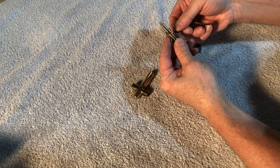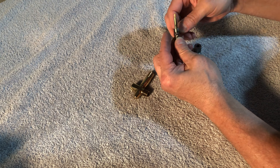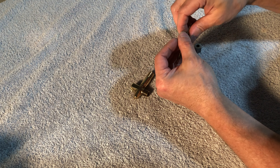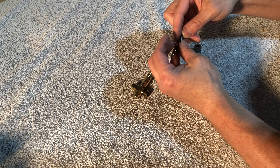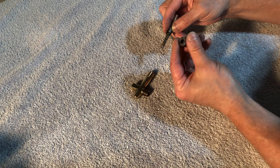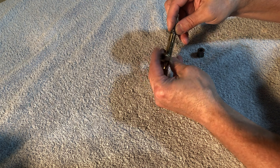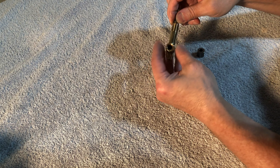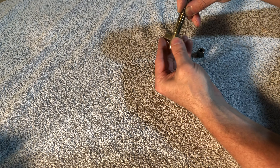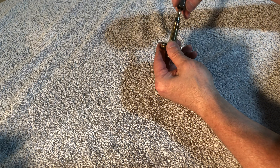What we do is wrap this around. I can't really tell you how many wraps to put on there — it's going to depend on the rope you're using. Three is probably going to be pretty good. I'm going to go ahead and try to use all of this because this is a fairly large valve. So you wrap it around in a coil. My rule of thumb is use enough that it's difficult to get the valve stem nut back on. So we'll thread this in. I'm going to screw the valve all the way in, and this will help some of that packing to work its way in. Notice the packing is basically like a thin sheet of graphite that's all coiled up, so it's got a lot of room to compress.